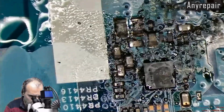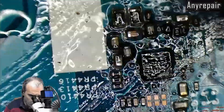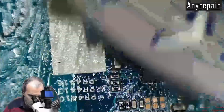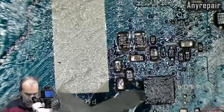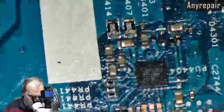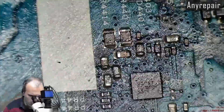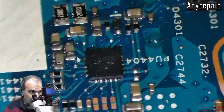We will clean with isopropyl alcohol and check the condition of the board. Rub with a toothbrush — not very hard — just to remove any corrosion that is softened by the heat and the flux. Do this as many times as needed.